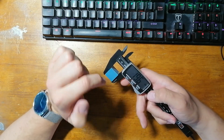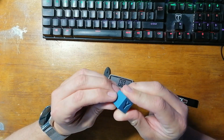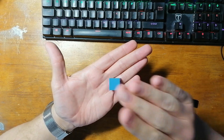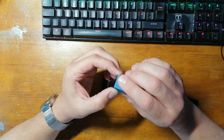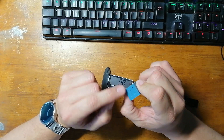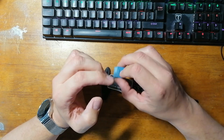My Z is actually a little low. That won't affect this print because it's the height I'm not worried about - it's the thickness. But what it's telling me is that it's not printing high enough. You've got to look at why it's not high enough, and if you look at the bottom of this print, it bulges out at the bottom - that's called elephant's foot. It can be caused by the bed being too hot, or the initial layers being too hot and melting together. Since I've already lowered my initial layer temperature, I'm pretty much certain it's the bed not being level - too much squish causing it to bulge out. So I'm going to re-level the bed and try again.